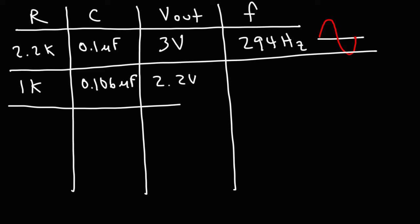Actually, one more important thing for those who may want to build this circuit: the ability to tune the circuit to the desired frequency. Since R and C control the frequency, you want to tune one of those. It's hard to find a variable capacitor in the microfarad range — they typically go up to 100 or 400 picofarads. However, you can tune the resistors using a potentiometer. Specifically, a triple gang potentiometer lets you adjust all three resistors simultaneously, which is perfect for this circuit.